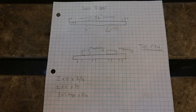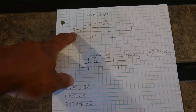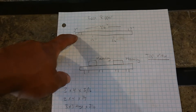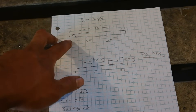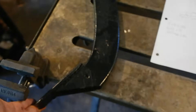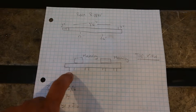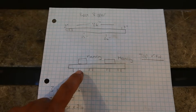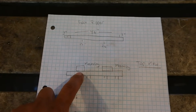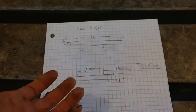Here's a little drawing of what we're going to be building today. The total root ripper bar is going to be 46 inches in length. I'm going to be placing pieces of angle iron every 10 inches on the back to hold our rear cutting tines, which are these right here. And then I'm going to be mounting this to the back of my A-frame adapter that's on the three-point hitch, mounting it in two spots using these pieces of rectangle.